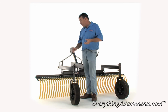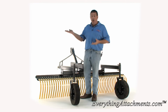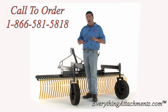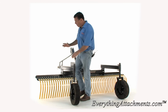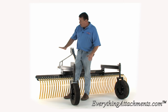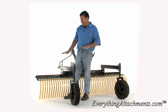One of the manufacturers I talked to, actually, we talked about making our own tine and getting them heat treated to be a spring tine, and that's a lot of the trick. It's a special alloy and a special heat treating process that makes a good tine that will spring but not break. So there's some things I've done here to make this better. To start with, this has 6 inches of contact area where the tine is flat to give you some surface area there just to make it better, okay?